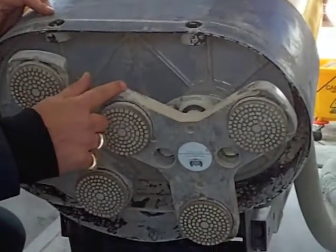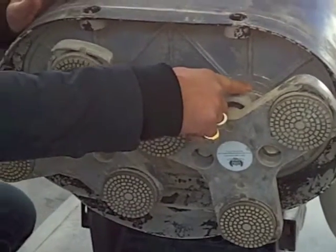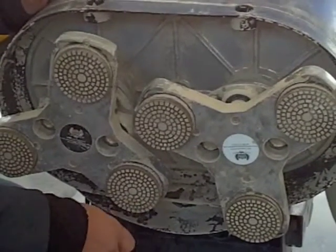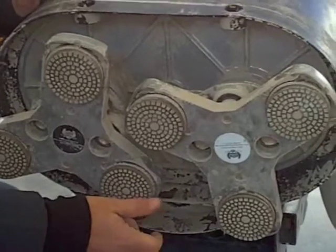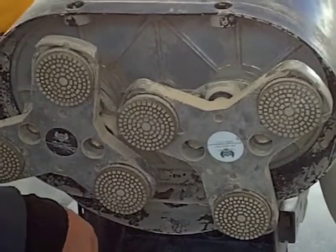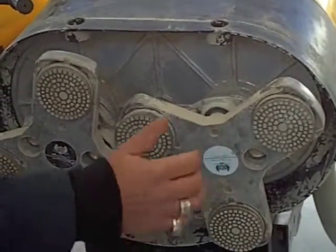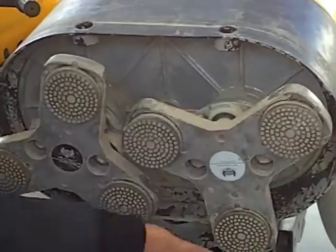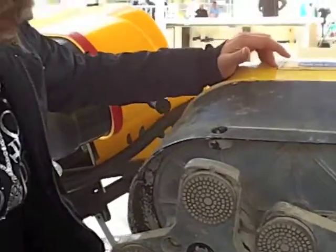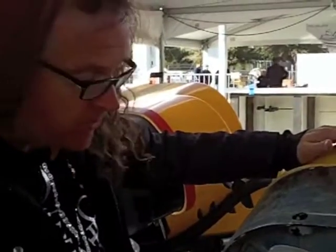This particular machine has got more flex couplers on it like a lot of the larger machines do. This one weighs 350 pounds. You can add a 45-pound weight or you can add 75 pounds of water to the water tank — you have a 9-gallon water tank on the little Classic Genie. This machine is 25 inches and will do 750 square feet of full polish a day mechanically, taking you through a 9 to 10 step system.